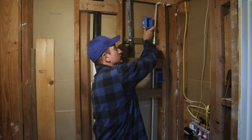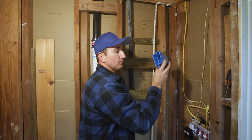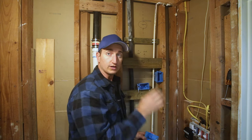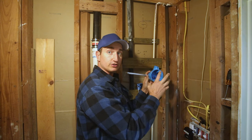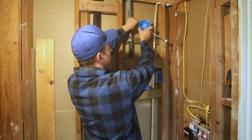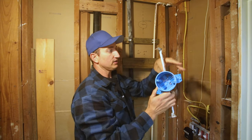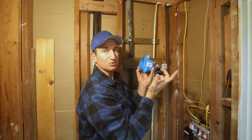I need to find where I want this light to be. I can base it off the center line of my intended vanity — I'm committing to a 25-inch vanity, so that's my center line. I marked a height for where I want the light fixture to be. I need to get an electrical box up here, and one option is to put framing in and secure it to that. However, I've noticed with some boxes that the trim fixtures don't cover the corners, so another solution is to use a round ceiling box, which tends to fit better with light fixture coverings.